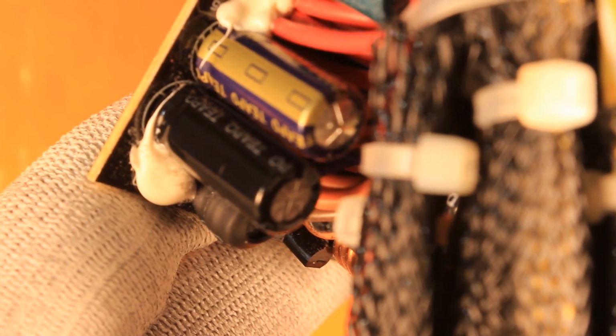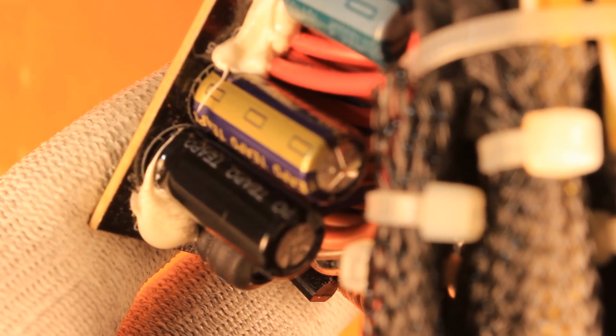And also, I don't know whether you can see this capacitor right there, and it's no longer happy. If we would make a quote from the Monty Python's Flying Circus, there is a sentence in the Dirty Hungarian Phrasebook where they say something similar to "my capacitor is exploding with desire." So as you see, the lid is definitely popped on that one. So yeah, that's most probably why my virtualization host and video editing machine is not booting.